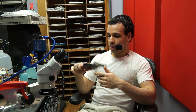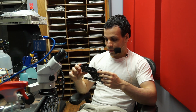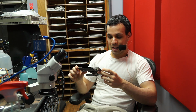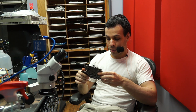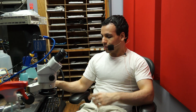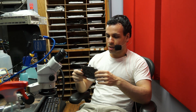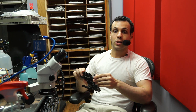So what's going on with this board? This is a board that had lemonade spilled on it. The customer asked that I would do a video on fixing it, which I did not do because their board wound up being a nightmare, and I wanted to go home. But I want to go through what I did to fix it and my thought process. This came in with the problem that it works slow off the battery - really, really slow. And that's usually a sensor issue, whether it's current sensing or voltage sensing. There's usually some sensor on the board that's not reporting proper information to the SMC, and that causes the SMC to say let's just run really, really slow - let's not turn off the computer, let's just make it stay on but be unusable.